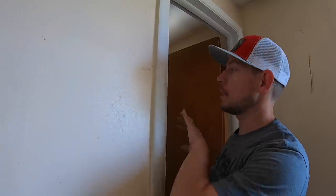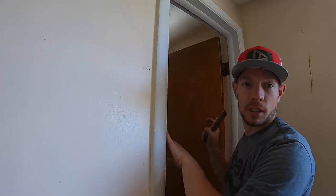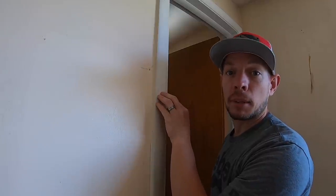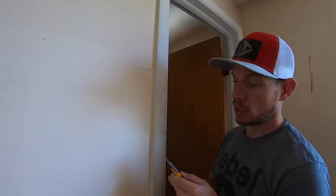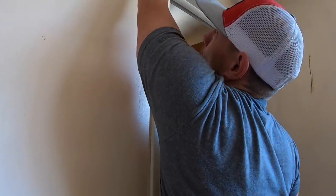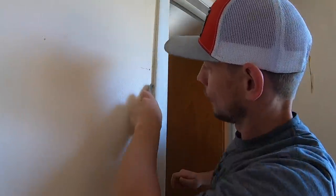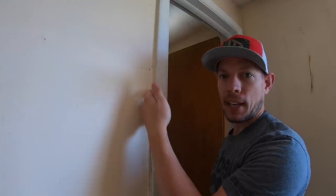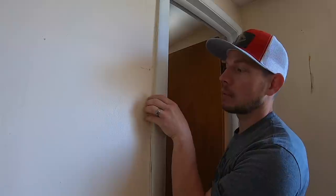Let's get started. There are a bunch of reasons you may want to remove trim — maybe you're going to replace the door and the jamb at the same time, which I recommend always doing. If you replace a door, replace the jamb with it. First trick is to cut along this line of all of the trim. Even though I'm getting rid of this trim, I still want to make that cut line, because if you just rip it off, sometimes it'll grab the paint and tear it out really abrasively.